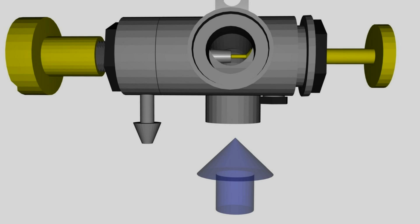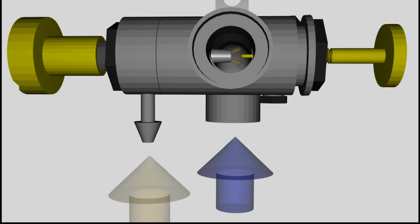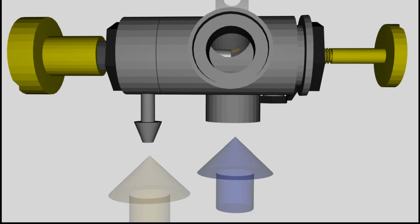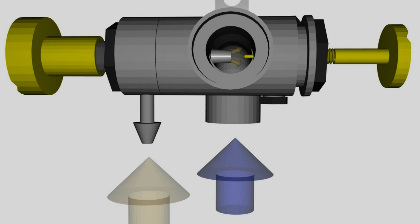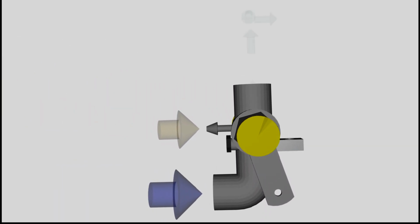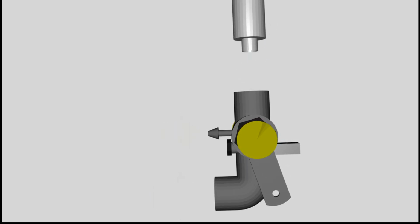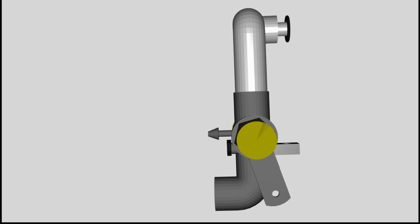By opening the throttle, the idle screw is moving slightly to the right along with the barrel, by which the fuel valve is opened too. The fraction of fuel is increasing, leading to a richer mixture. With the help of the idle screw, the concentration of fuel is altered while the throttle is actuated. Fuel and air enter the carburetor, and an explosive mixture of both components is coming out of this device.